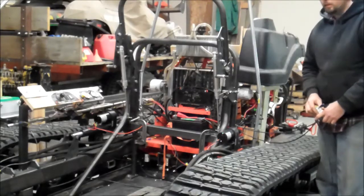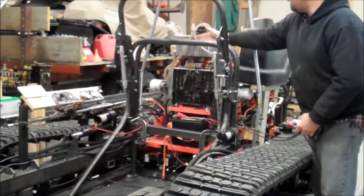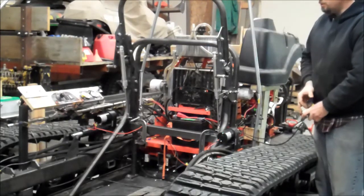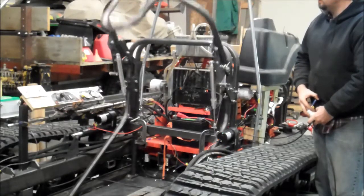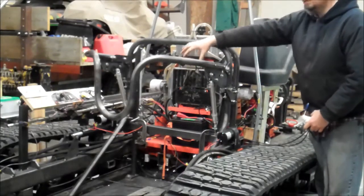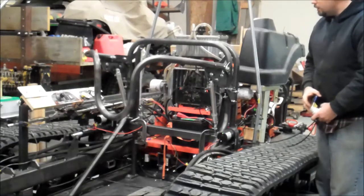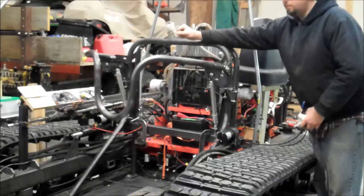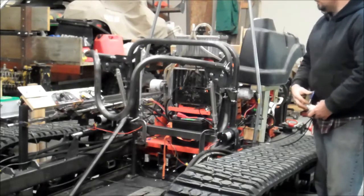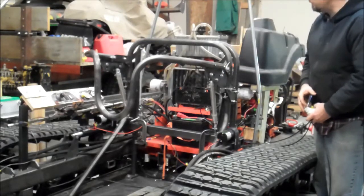So that's our safety bar. There will be seat belt straps that attach here and go back and around. There's a headrest and shoulder rest here. When this closes, those seat belt straps come down over and provide shoulder restraint for the user to further lock them in. There's a lock down on the floor for the wheelchair, but there isn't a lot of support up here otherwise. Those shoulder straps will provide upper body support when locked in. That's another reason why we want to make sure this always releases so the user is not trapped in the chair from a safety standpoint.